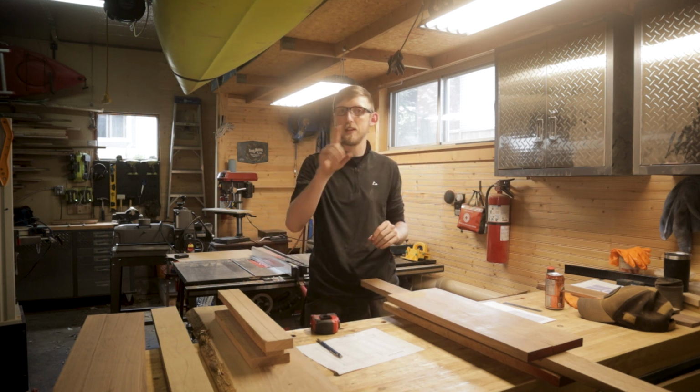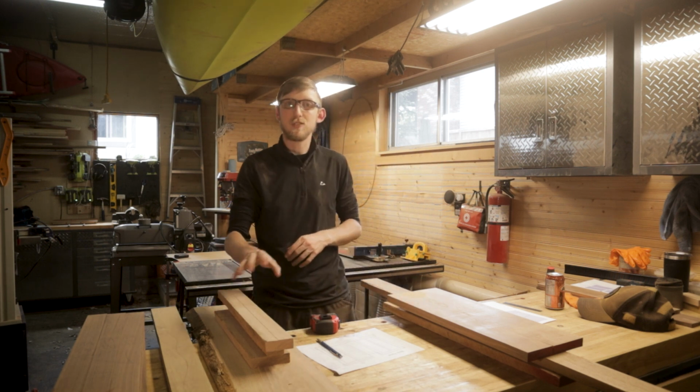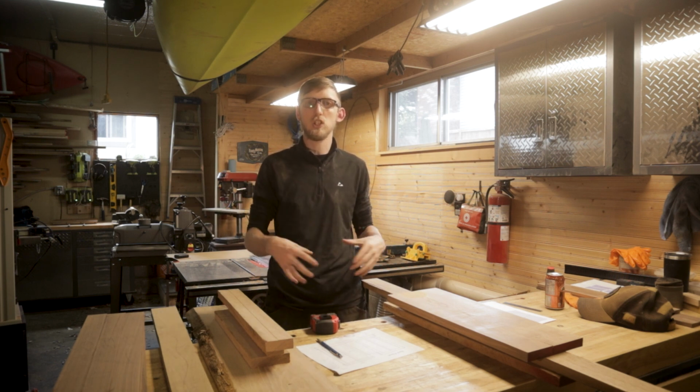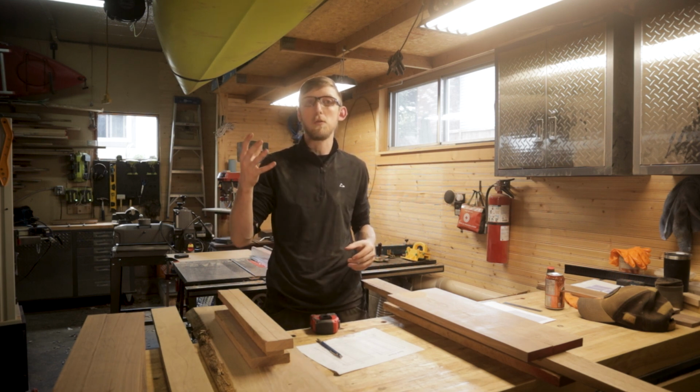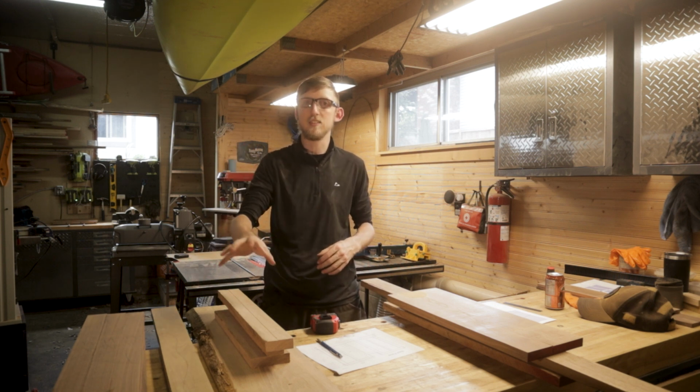So we left those rabbeted areas mounted to the back area of the actual cases themselves. This pile is for the back panel that's going to stretch between the two and actually give this thing some rigidity and some structure when it's all put together. And those are where we're going to be using those threaded bolts and adding some threaded holes to the tenons on some of these pieces here.